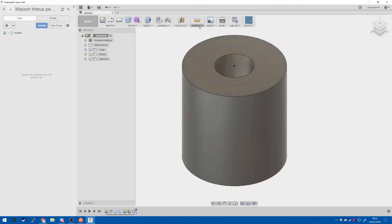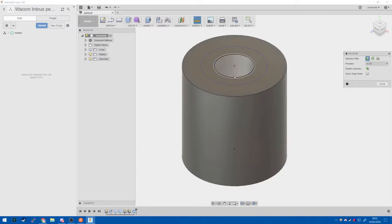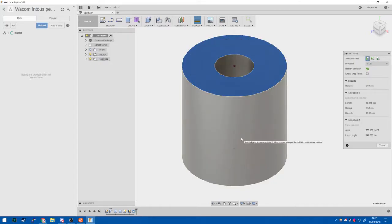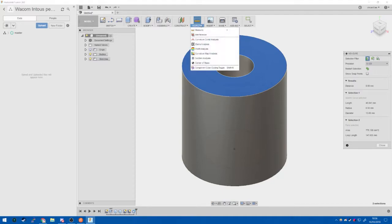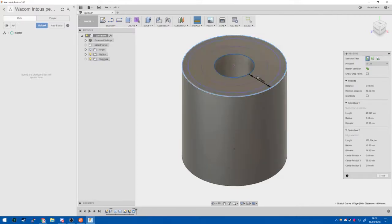I'm going to go home. I'm just using a mouse because these are quite little changes. Okay, radius 6. So yep, that's the same diameter. So that's working perfectly fine. If we want to go and inspect this again. Okay. Measure. So that's 15.5 now, which makes sense because we're not really changing any numbers. 10.5, sorry. So 10.5 millimeters.